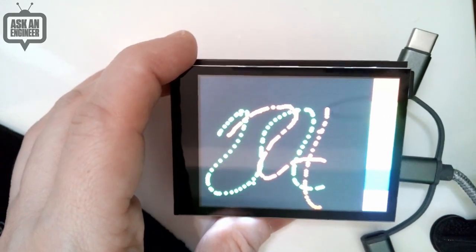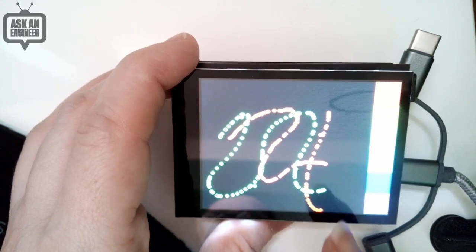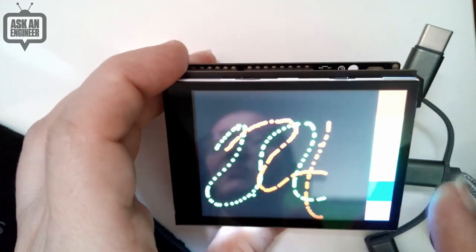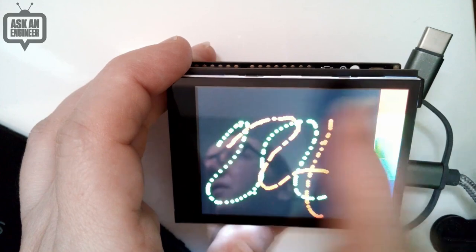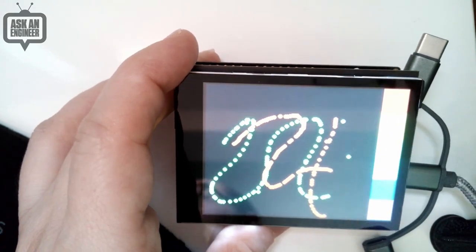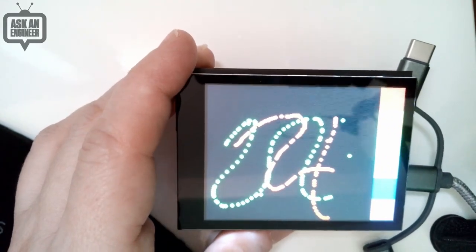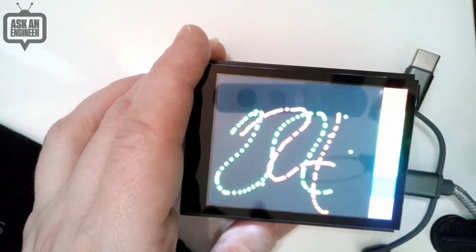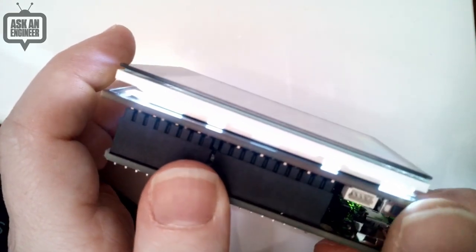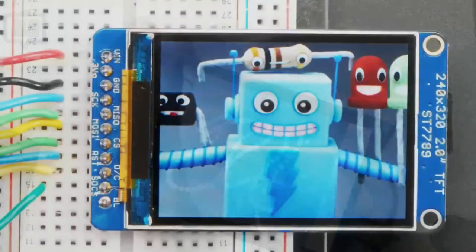But you know what? It actually works in CircuitPython as well. It's got the FT6206 capacitive touchscreen. It doesn't do multi-touch, but it's very basic and gives you the 240 by 320 pixels to touch points, and then it's got that 320 by 240 ILI9341 screen, all connected over SPI for the screen and I2C for the capacitive touch. So the big update, as mentioned, on the side now we've got this reset button that's easy to get to, and a STEMMA QT port for adding I2C sensors easily.